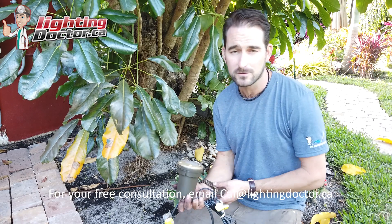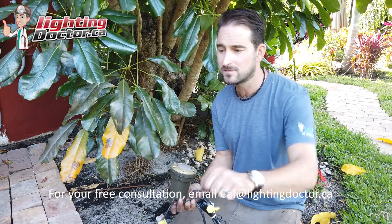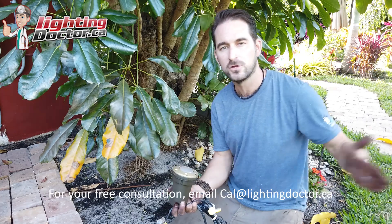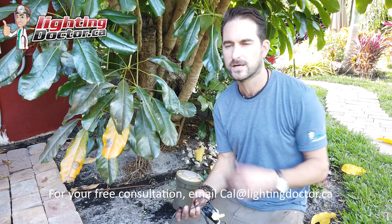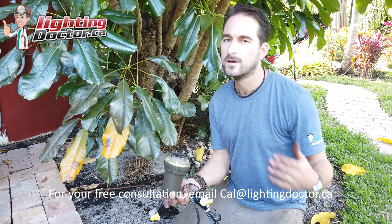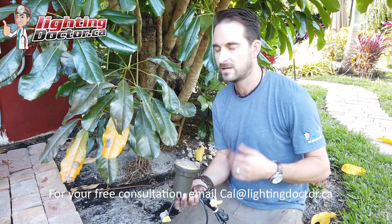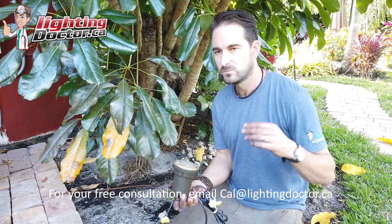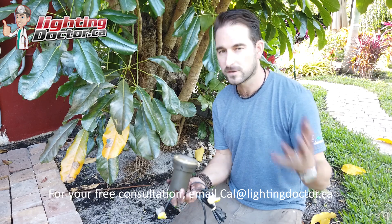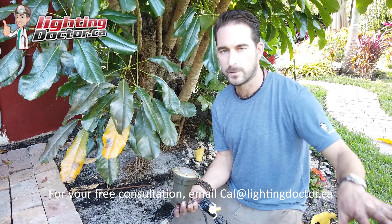It's not that tough to find the issue, but it's a lot more time-consuming. Instead, wire five to ten lights, plug back into your transformer, turn it on, make sure everything's working, then keep going. That way if you do have an error it's easier to troubleshoot within five to ten lights than with 20, 30, or 60. Especially if it's your first time — test as much as possible while everything is still exposed.